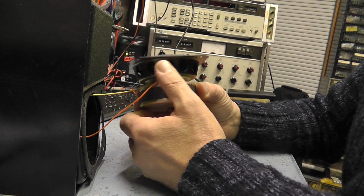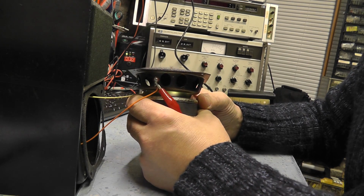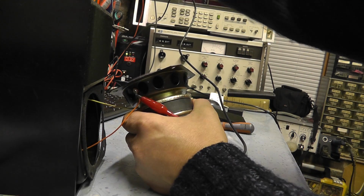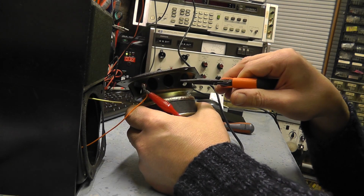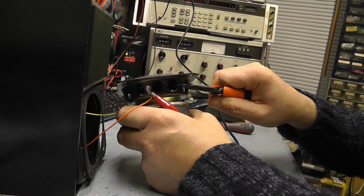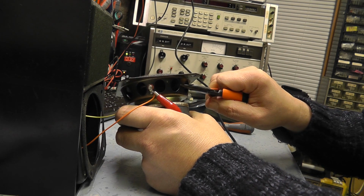So what I'm going to do is get a pair of pliers, and this is the last resort. I only do this on speakers that are sort of beyond the pale. If I get a pair of pliers in here and apply slight pressure each side, and just get in between here and apply a bit of twisting action, it will twist the whole chassis of the speaker in theory, and possibly, maybe, doesn't always work, get rid of this buzzing noise.